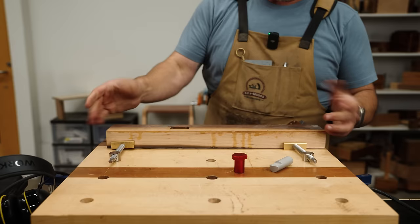The second way to remember direction is the right-hand trick. You take your right hand and point your thumb in the direction of your router bit — the bit is going to be going in the direction you close your fingers, so it is scooping. To add it to the picture frame model: our thumb is down. When we are going outside we want to be scooping our material this way; same thing when we are inside. So clockwise on the inside, counterclockwise on the outside. The third thing about use is how to hold your router. With a full-size router with handles, you want to put your weight down on the hand and area that is supported by the workpiece, and use your other hand just to guide it.